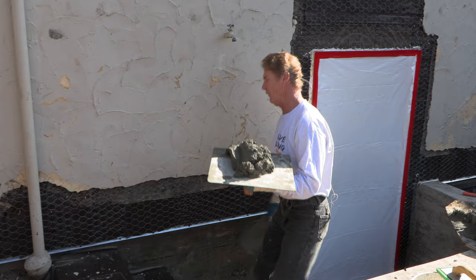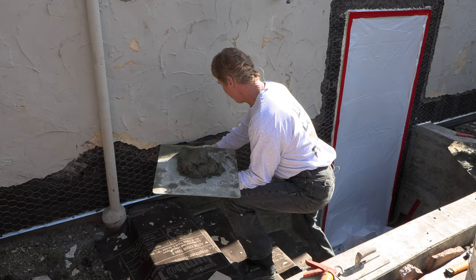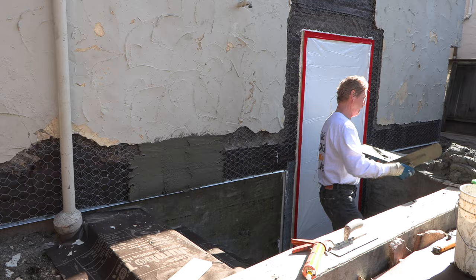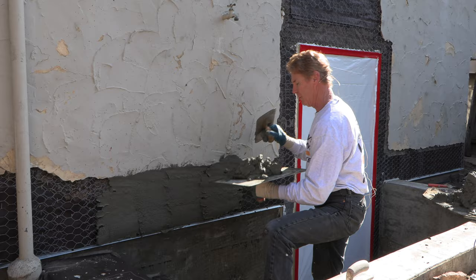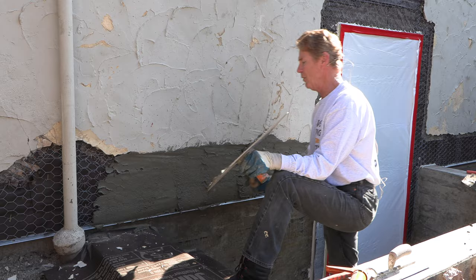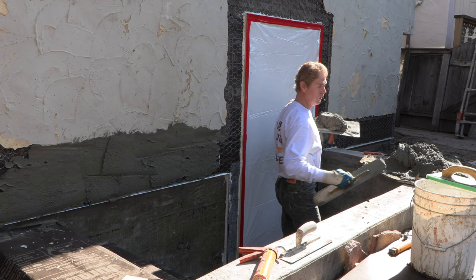What we do first is match this — it's kind of a swirl finish, a weird finish. Anyway, we're going to scratch it. There are a lot of ways to do this; here I'm scratching it. That's the first coat of stucco. The mud is a little bit tight, but that's okay. I'll improvise — because it's tight I'll go over my own scratch immediately. We can do that — get it up there, get it to adhere in that joint.